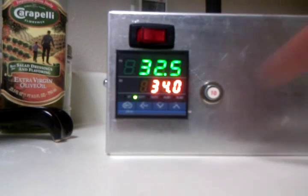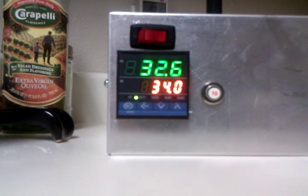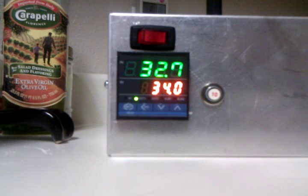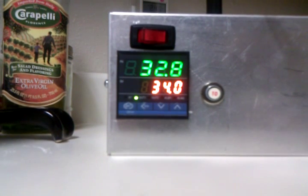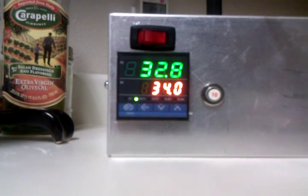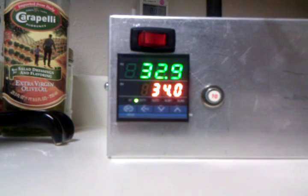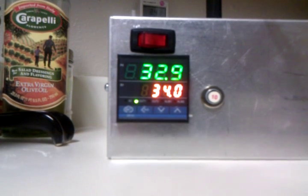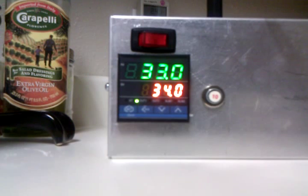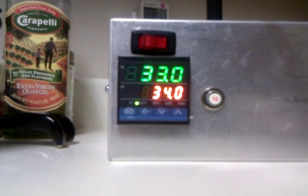On the right we have a 10-amp thermal circuit breaker. We were reading about 2.36 to 2.37 amps for each of the immersion water heaters — you can see it cycling on and off for the temperature. So that's about 2.36–2.37 amps per water heater, meaning three of them is about 7.11 amps. I was also intending to plug the pump into it, so I gave myself another couple of amps for that. Fry's only sold 7-amp or 10-amp circuit breakers, so I went with a 10.